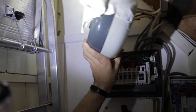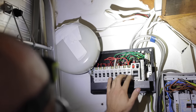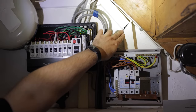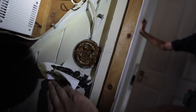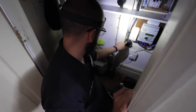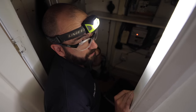We've got this which I imagine is not too clever, and I'm not sure what that is yet either. This main board looks unmolested to be honest, but this one here we've got a different make breaker shoved into it — a classic bit of mixing from the previous spark or kitchen fitter. We've got basic insulation showing at this doorbell. We have this which has just been gaffer taped up and that's actually live, so I'll pop that back on and try to make something a bit more permanent. It's just going to keep falling off. We're not sure if the water's bonded. The tag's missing its label. There's basic insulation showing at the Henley block. These tails are undersized for the new head that's been put in.